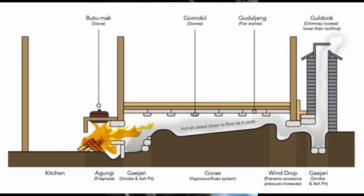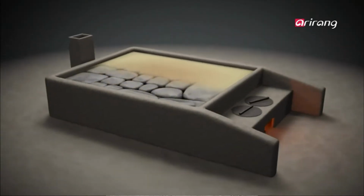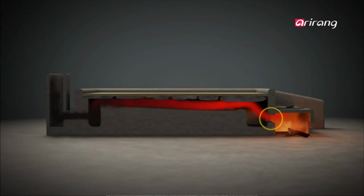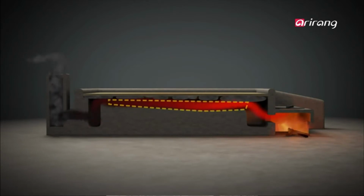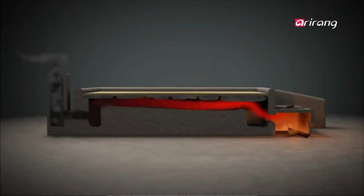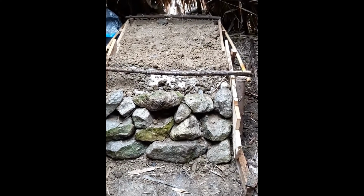Basically, this stove works on the principle of mass heating, which is an older principle of heating the home, more common before the advent of electricity. Mass heating relies on radiant heat versus convective heat. Most wood stoves, for example, rely on convective heat, which essentially heats the air only and is a lot less efficient, so you end up using a lot more wood for the heat output. Mass stoves, on the other hand, are based on radiant heat.